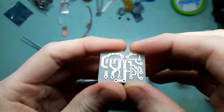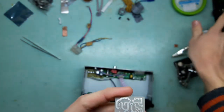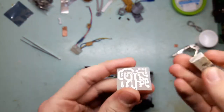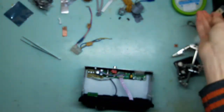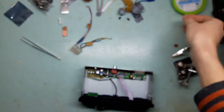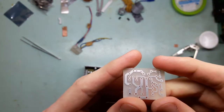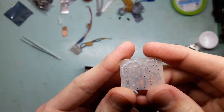It does put a very light coat of tin though, so you can take something abrasive and rub it off. Like this kind of eraser, it will easily rub it off, especially this dark side. Dark side. Evil. But, you know, you don't need a huge coat, you just need to protect the copper from oxidizing, and it does that awfully well.